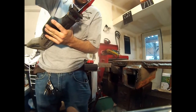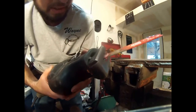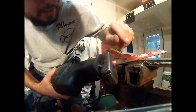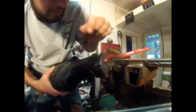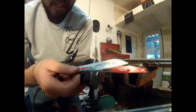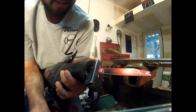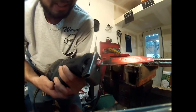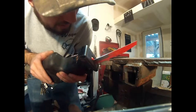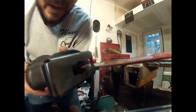That seemed to cut okay — a little slow, a bit slower than the other one. It looks like we did start to generate quite a bit of heat, but the heat is up here, not actually in the teeth, because the teeth are carbide strip and carbide deals with heat extremely well. Had this been a regular bi-metal blade, that bluing color right in this area would definitely indicate that those teeth are just about to start failing.